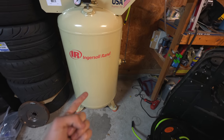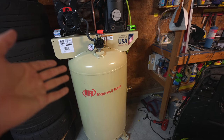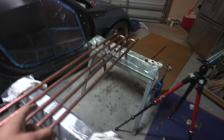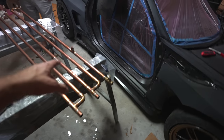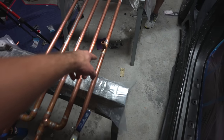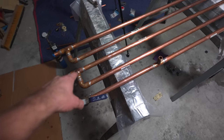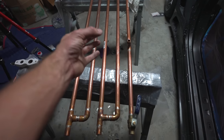This will preserve the life of the tank and be an extra way to reduce moisture when we're ready to paint. I know it's a convoluted setup, and some of you mentioned I should just get an air dryer coming out of the tank. But the way I see it, an air dryer is one more component that uses electricity — if it fails it holds up all progress during paint. The idea is that the inlet side takes the air and it travels through each one of these legs, cooling off as it goes, which allows water droplets and moisture to build up and collect at the base of each leg.